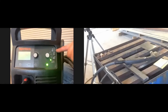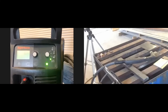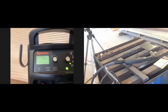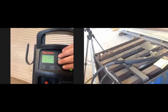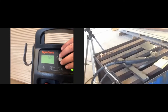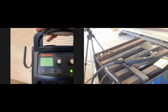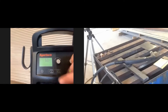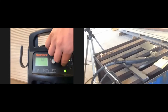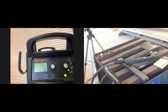The bottom setting is like the standard cut but with a locking trigger — you click once and it continues cutting without holding it. On the other side of the machine there's an amperage dial you can turn to increase or decrease amperage. Thicker metal means you adjust it up, thinner metal means you adjust it down. You can also adjust air pressure, but typically we just adjust amperage and select the right mode.